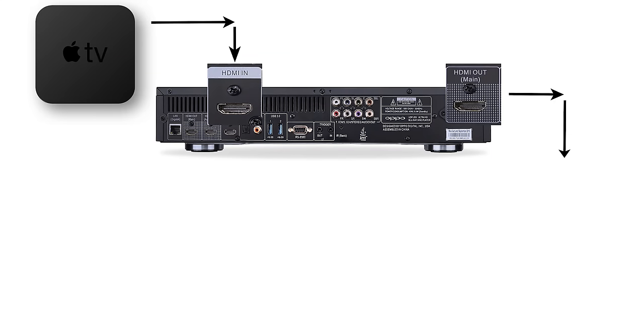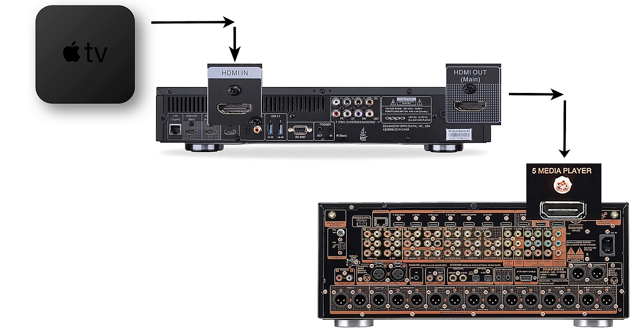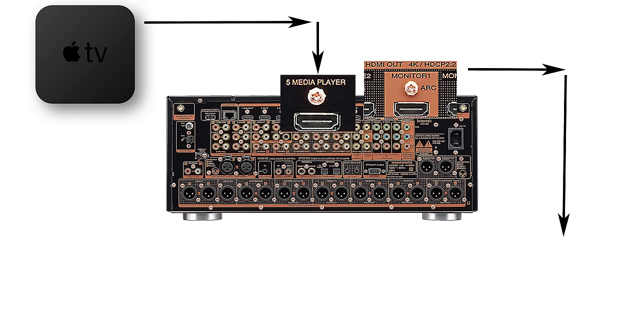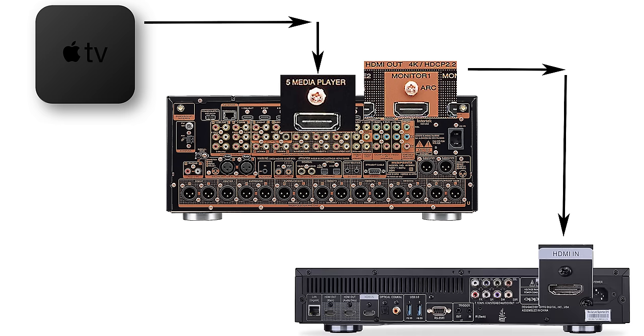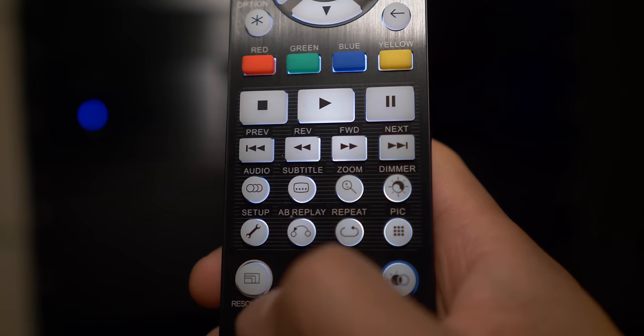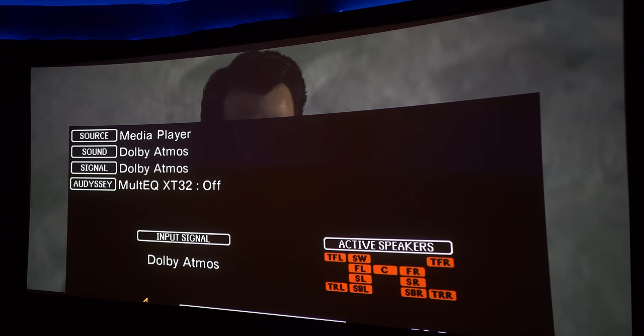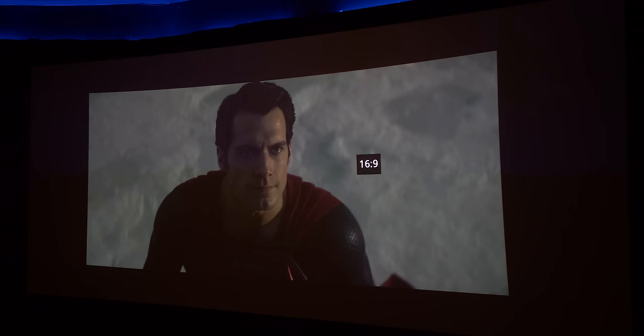Normally you'd have the Apple TV plugged into the Oppo, then from the Oppo to the receiver or processor, then to the projector — the normal way — but this way equals no Atmos. The workaround is to plug the Apple TV into the processor or receiver so the audio gets decoded first to the speakers, then the HDMI output from the processor or receiver goes into the Oppo, so you can hit the zoom button and have it fit the screen.